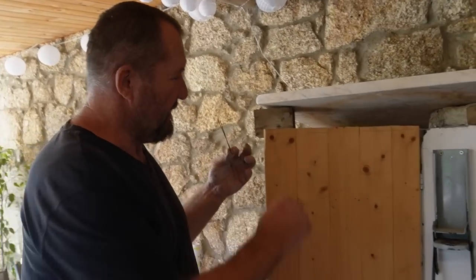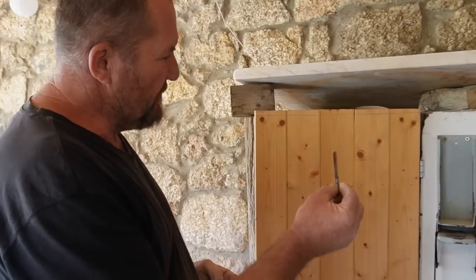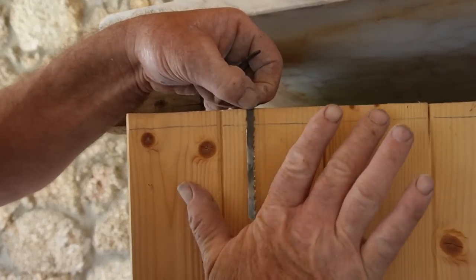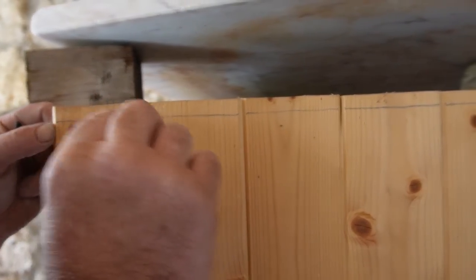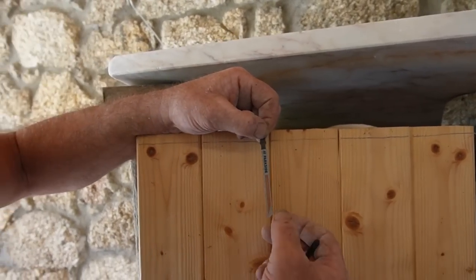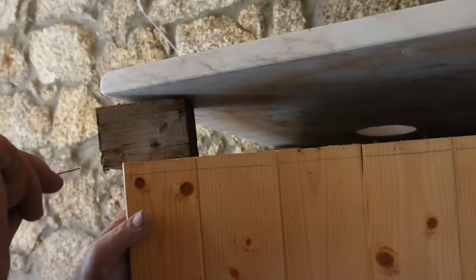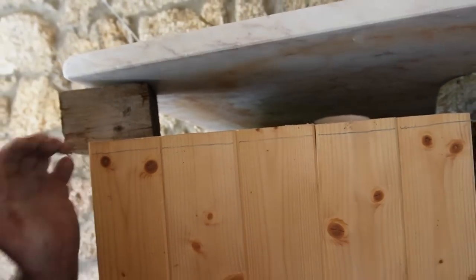Okay, I'm going to use a jigsaw to cut this in situ so I don't have to unscrew all the door and everything, make it easier. The only problem is with a normal jigsaw blade here, as you can see, the teeth pointing up. So when you cut, it pulls towards the jigsaw, which on this edge, you get a frayed edge. But what I have is what they call a reverse cut blade, which cuts on the downstroke. So that pushes on that stroke going down, so you don't get a frayed edge on this edge. We'll give it a go.